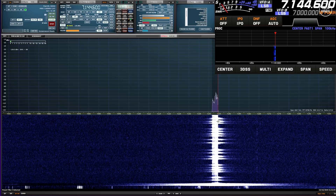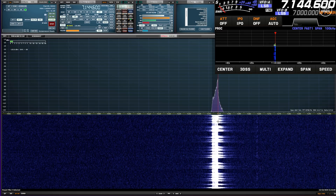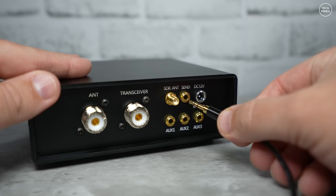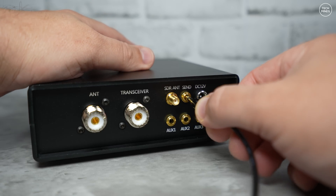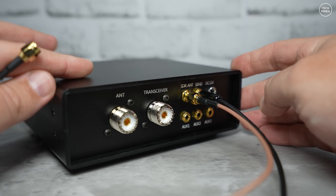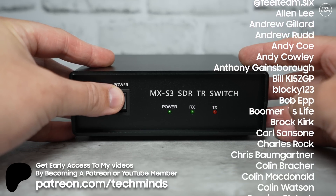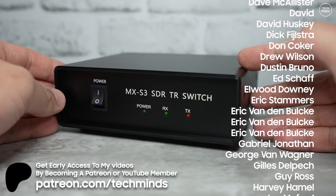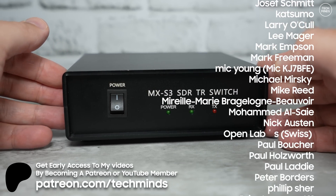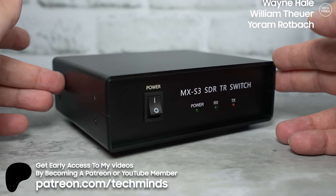With this transmit example, you can see that the SDR's input appeared to be grounded or at least isolated to dampen the transmitted signal from entering into the SDR too much. That's the MXS3 — let us know in the comments if you've got one of the other versions shown before on the channel. This is one of the latest versions, and the losses we saw earlier were more related to the actual SDR port rather than what's going to the radio, so I think that's acceptable — unless you really need to measure accurate power levels on the UHF bands. Thanks so much for watching, take care, and I'll see you in the next video.